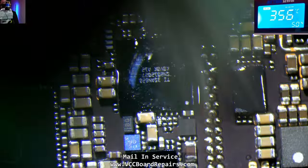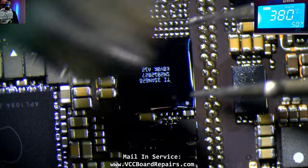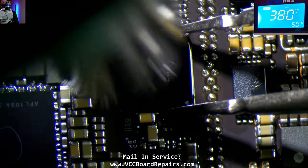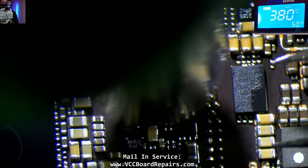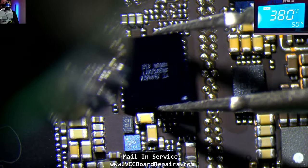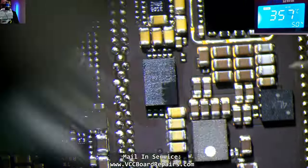I do have a big nozzle on right now because I had to do a few CPU swaps that required it and I didn't move it over, but it shouldn't be a problem. I'm just going to point my hot air the other direction away from PMIC. This is the donor — the one I used to test and confirm that touch works and that it charges. Here's the EEPROM — I believe it's called EEPROM. If it's not, I'll correct it in the description.